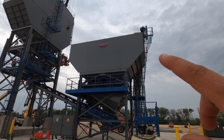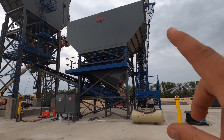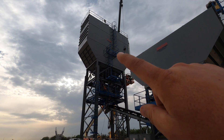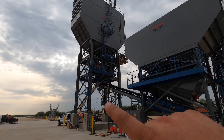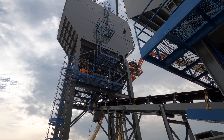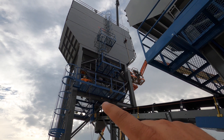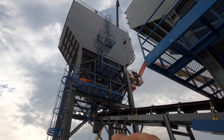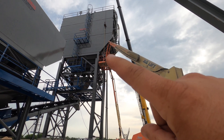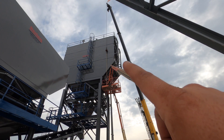The last two videos were little montages of putting the plant together. The first piece that came in was this — the aggregate side, which houses aggregate, rock, and sand, fed from the stacker conveyor which then goes up here. In the fourth video, just right before this one, is when we installed this main structure — it went pretty quick but was a lot of work. Right now we're finishing up all the little details: a cement batcher and a water batcher that hang and have to be held by load cells to get everything weighed.